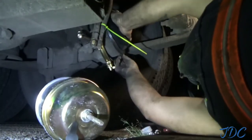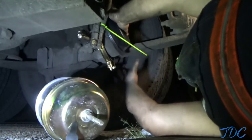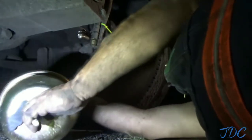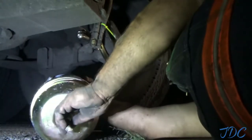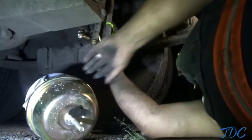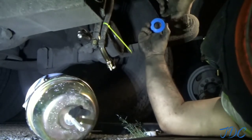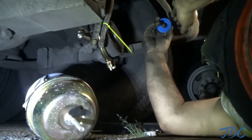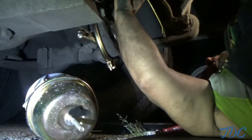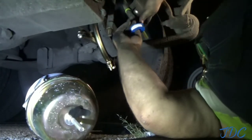Well, you got to start fixing these air leaks. They were going to put an air compressor on. I said, there's nothing wrong with the air compressor. You just got to fix the air leaks. The air compressor is working fine. But I'm just a mechanic, I don't know much. Some don't like to go to the root of the problem. They just like to throw parts at it. Well, you do have to fix all your air leaks, that's for sure.